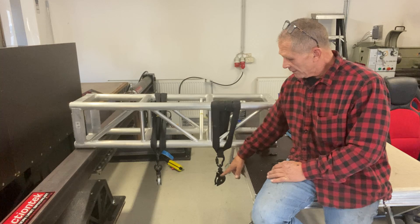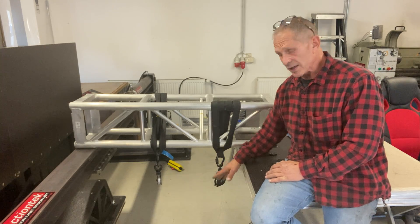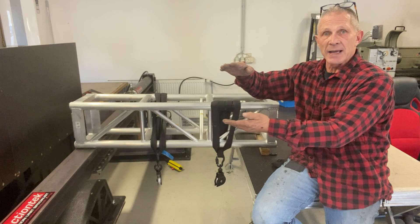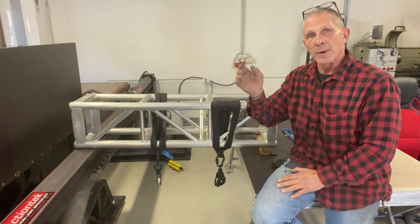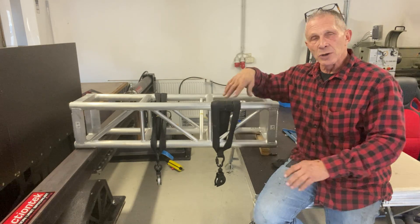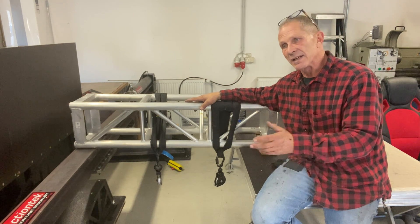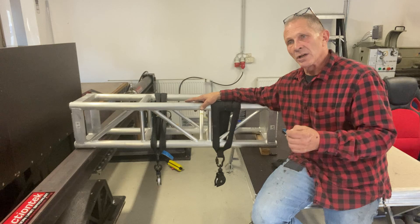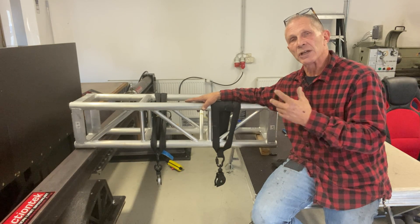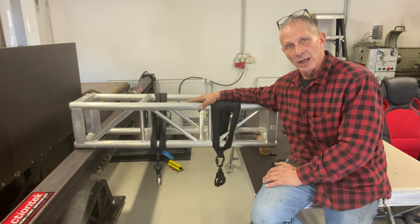If you have 150 millimeters down here plus the eye, you've got this much room on every span set to swing. You add that up over six pulleys, eight pulleys, ten pulleys — you've got a huge amount of distance to pull before everything's in tension, which means your pulling efficiency with lifting people even on a hand pull is minimized. You have to travel a huge distance just to get tension up.